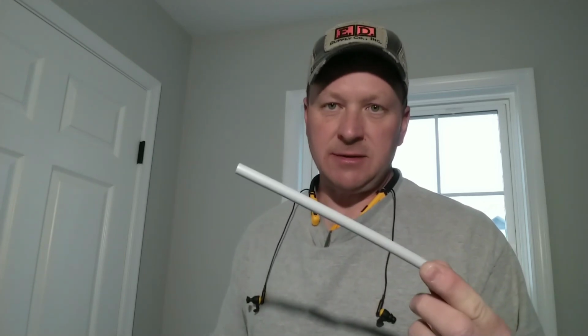Ladies and gentlemen, that concludes our video presentation of spacing your outlets and the alternatives that you could use for traditional 1/8-inch stack spacers. If you all decide to do this option, please ask your electrical inspector if he will approve this before you go through the extent of spacing outlets with this material. I want to make sure that you all don't cut your thumbs.